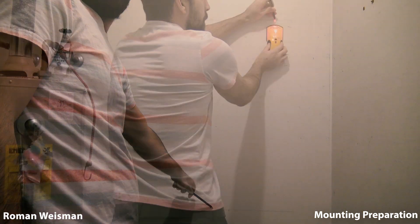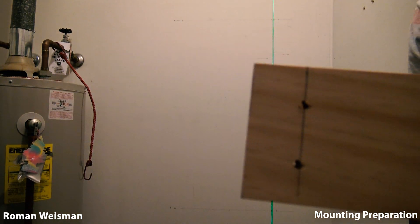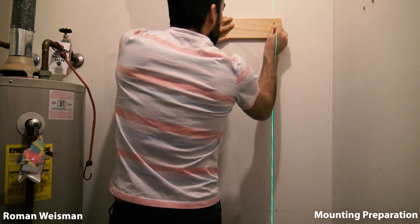The exterior distance between the support boards should be 34 inches, and those need to be mounted on studs. I have cut the boards one and a half inch longer, leveling the board and marking where to drill.